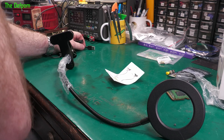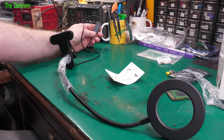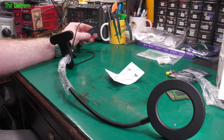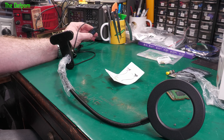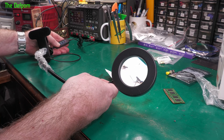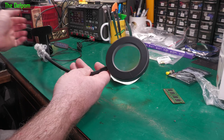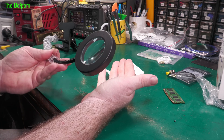Let's turn the power supply on and see how much power this thing uses. Plug that in — channel 4 out. When there's nothing on it's using 1mA. Turn the power on: 500mA, 530mA or so at full brightness. Then: 400mA, 300mA, 260mA, 220mA, 165mA, 128mA, 88mA, 33mA — 33 is the lowest. That's just barely on there, but it's still doing enough illumination if you're in a really dark area. As always I wouldn't use this thing at full brightness anyway — going down one level is 25% less power, 25% less stress on the LEDs, for almost very little difference in brightness.